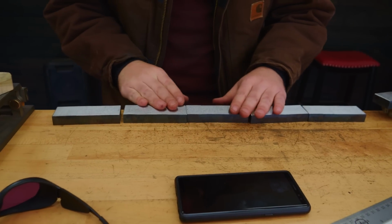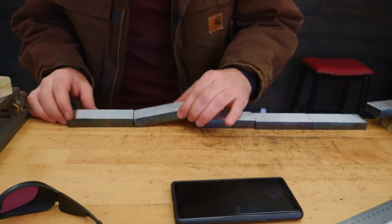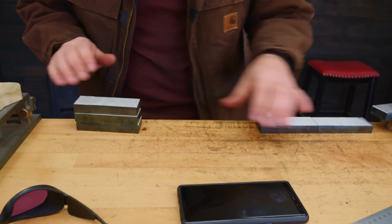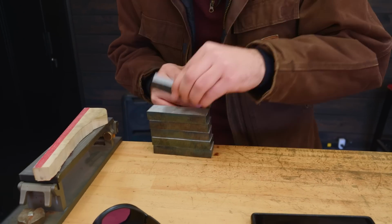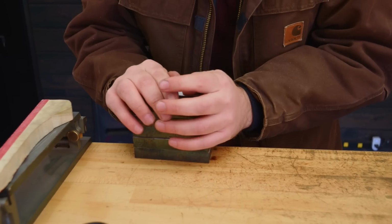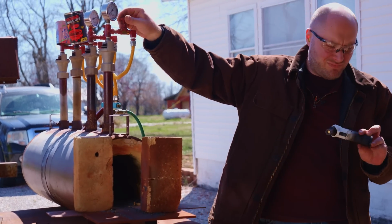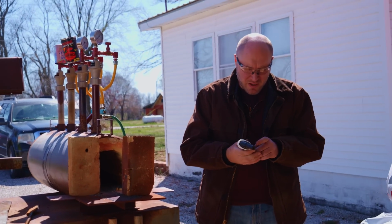I've got all the billet pieces all cleaned up. It's time to fold them so they mirror each other throughout. Flip, stack, flip, stack, flip. Now I'll clamp them together, seal them up with the MIG welder, get a handle on the situation, and throw this in the forge. Whew, lost some hair on that one.